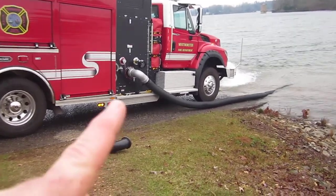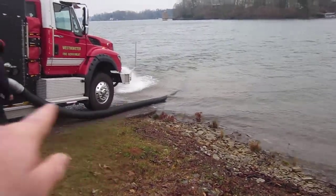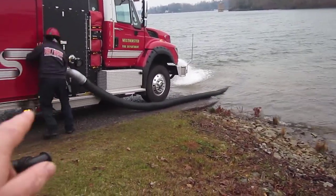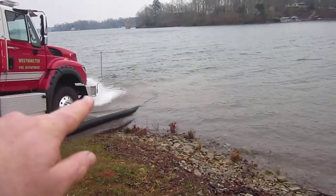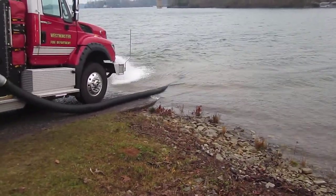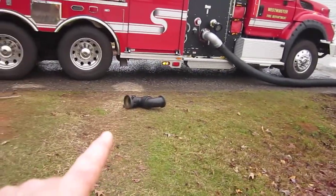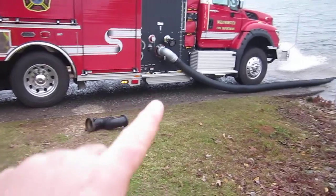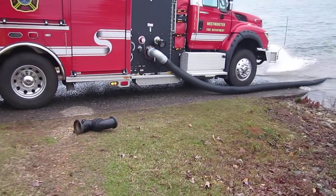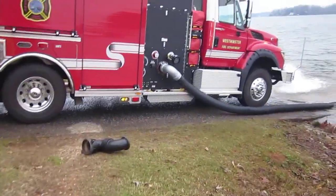You can see he's using a folded tank suction elbow through 20 feet of hard sleeve with a TFT strainer. It's on a boat ramp, so everything is good and secure. It was interesting to note that it had this suction swivel here that was pre-connected — he removed it, and is actually flowing more water with just that suction elbow.